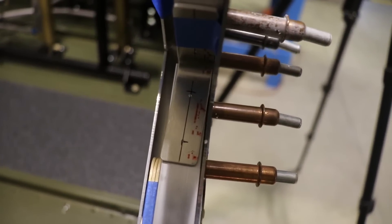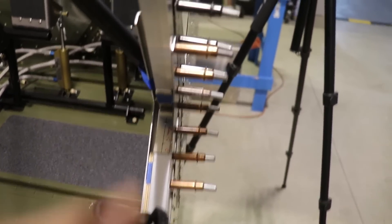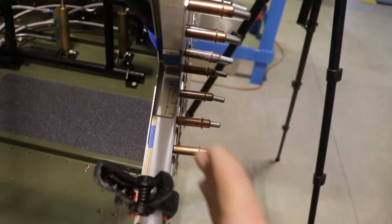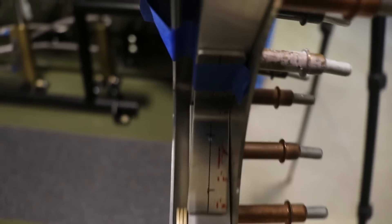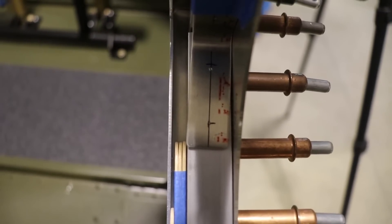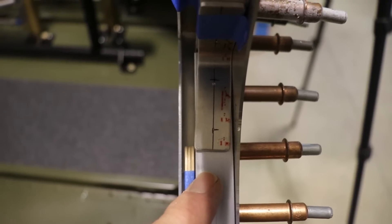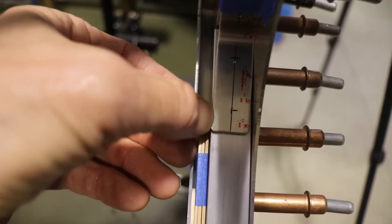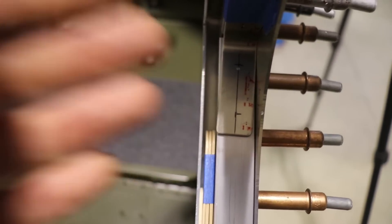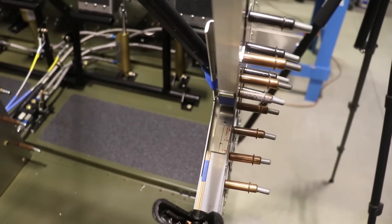For the bottom front angle, because the fuselage is angled inward, this tube is straight while this tube comes in at an angle, so the bracket is going to sit a little bit crooked. You can see I have it taped in place and the bottom is just a little bit crooked — that's actually how we want to build the door. What I'll do is draw a line on this corner and file it off a little so it's flush, but we want that crooked angle built into the door.